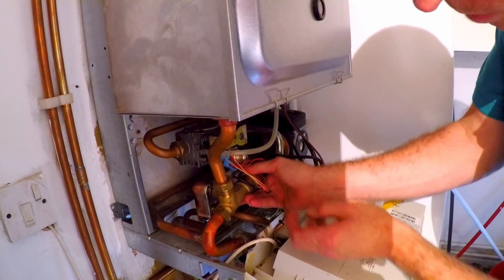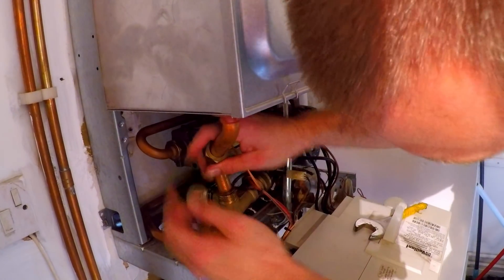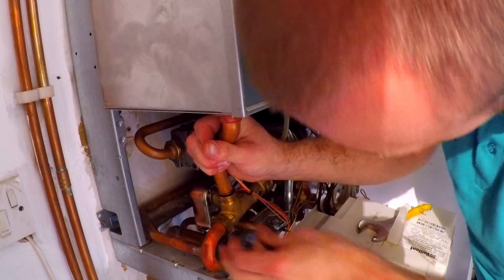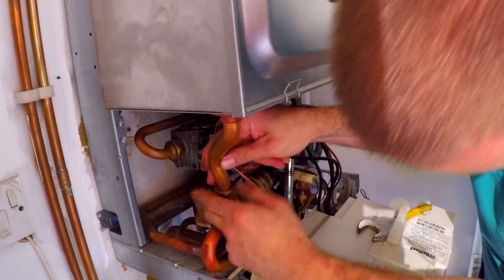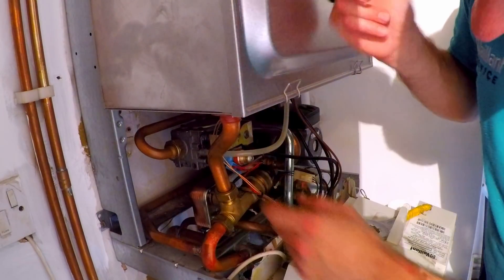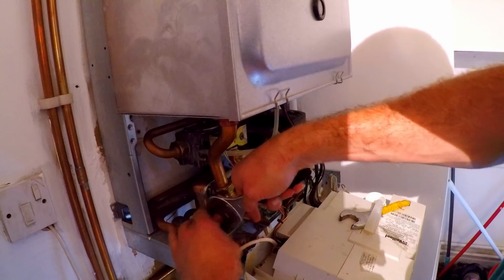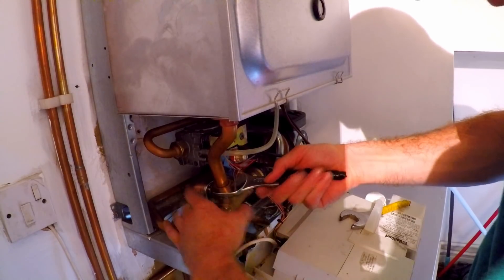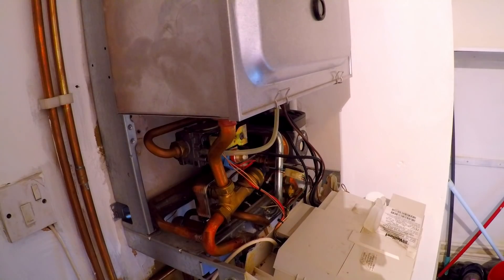Leave that nice and loose — this top pipe will twist in the heat exchanger when you're tying it onto the diverter valve. You want to be super aware of that and try to minimise it, because the more you twist it the more it turns in the heat exchanger, and you'll find you've got a leak in there. While I was outside I came and took the bucket to flush the plate out. I've already taken the drain down. Hoses off — let me dry it up a little bit.